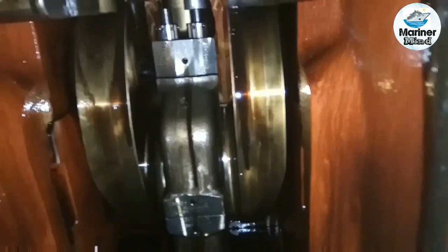This is a marine head type connecting rod. For opening the four nuts on the connecting rod, first open two nuts diagonally, then the other two. We can now install the hydraulic tools. Be very careful when slipping down the tools because the space is very congested.